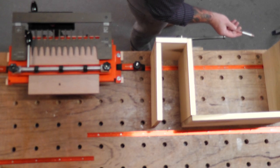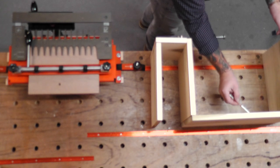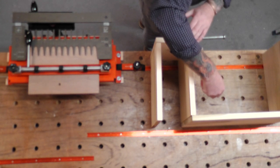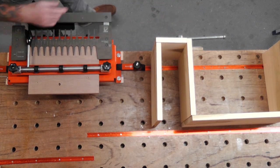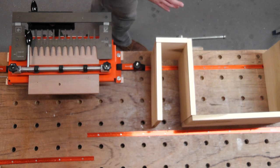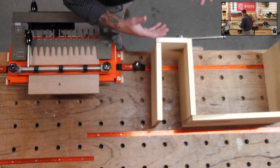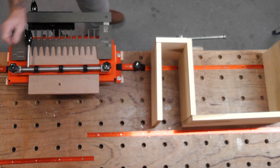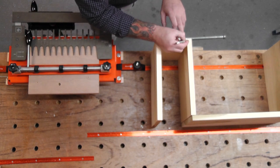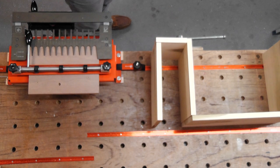All right. I'm also going to put a bigger cross on the inside so I know it's my inside faces. This marking's quite important if you've got a particular layout that you want, stuff you want to see and don't want to see. A bit of a knot or a grubby bit of grain that you want to hide away. So now I've got my layout. Fantastic. And I can even number these corners if I want, which I might do afterwards. That'll help me with my glue up.